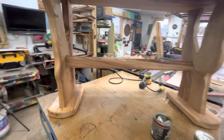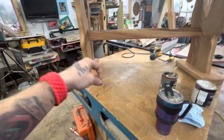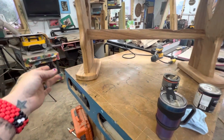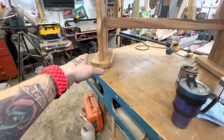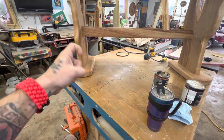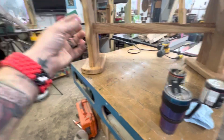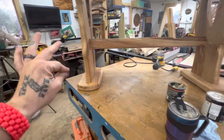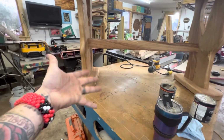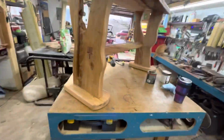If you want something that is high wear and tear, use polyurethane. If you want something that looks really pretty, like a piece of antique furniture, I would use a lacquer. And then you could even use something like a shellac, which y'all see me use on small boxes. Shellac gives you a protective plastic finish, really shiny if you want it. Or you could put wax on top of it. I've done that with stuff before. All right. Ramble, ramble, ramble.